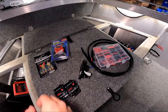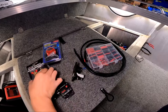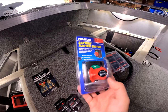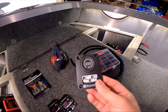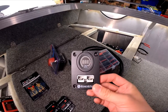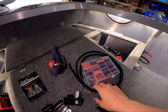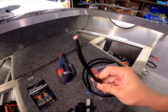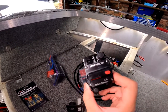This is everything we should need. We've got battery terminals just to make things easier to disconnect, two 50A circuit breakers, and a battery isolator for the Minn Kota. Most importantly, the flush mounted Anderson plug — and I think I'm going to put it right there. We're going to be using 8 AWG cable, leftover from my own car, rated for 100A which is not a problem because the circuit breaker is 50A.